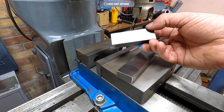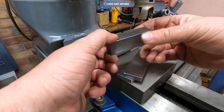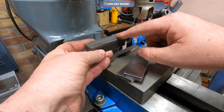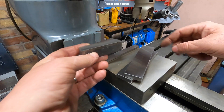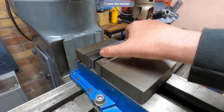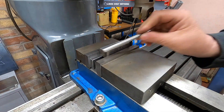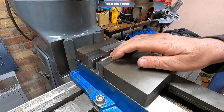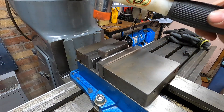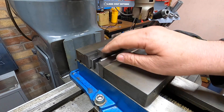One cut piece of metal - I didn't realize it was a laser-cut end, so I've had to burnish off the cut side so we've got a fighting chance of not damaging the cutters, because laser cutting does slightly harden the edge of the metal. So we'll put in some parallels, put the side I cut on the saw down, use that as a start, and get it as square as we possibly can.